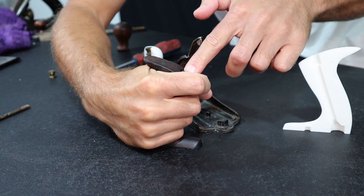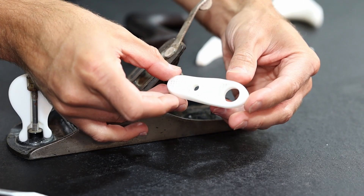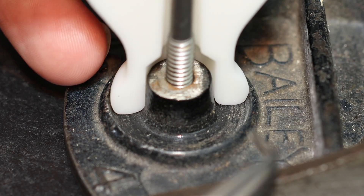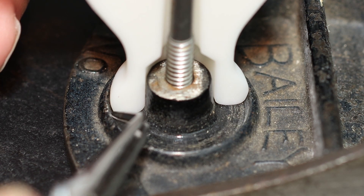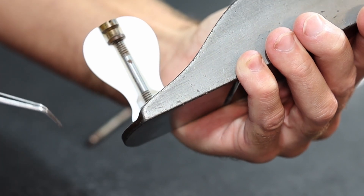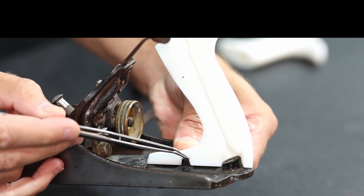By doing all of this I can raise up the front edge a little bit more to give more space for my fingers and also get more clearance away from the plane. These sectioned pieces help me to see what's going on inside. For the knob, the area at the base can be larger to fit more snugly inside the flange, and on the inside there's way more clearance than needed so I'd like to fill that area up toward the top. For the tote, I printed a template to check the hole sizes and position — the hole toward the front can also taper slightly upward for a better fit.